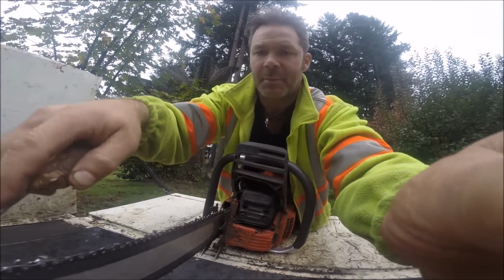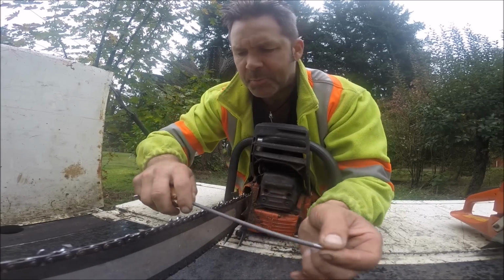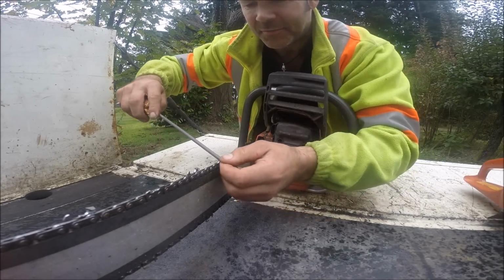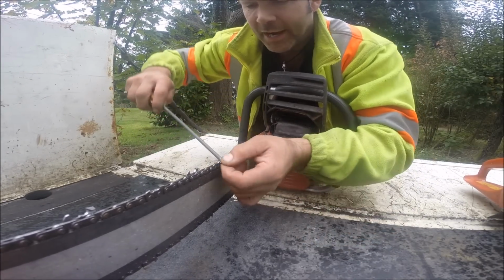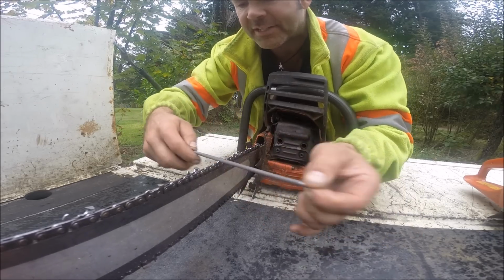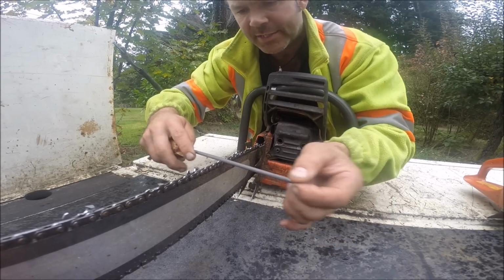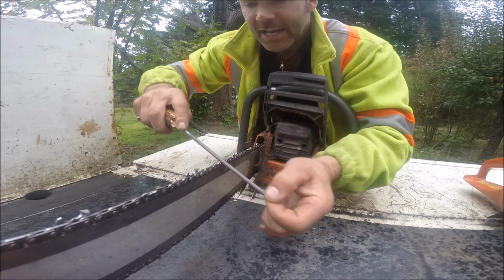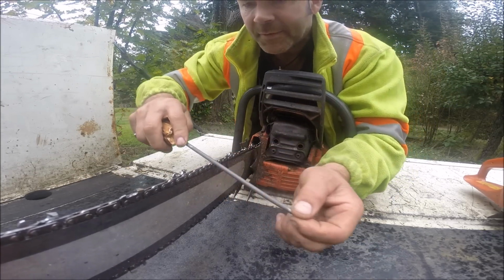And that's the boat, we call it. A few of the new subscribers probably have come across it. See, look at what the file's doing. Watch. Going for a boat ride. And then once you do that five or six times, depending on how much of the gullet you gotta grab, you straighten out. See? We straighten that file out, get our edge. This one needs it. You can tell it needs it. Big time.